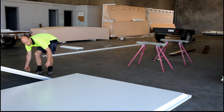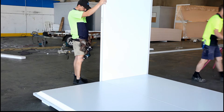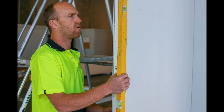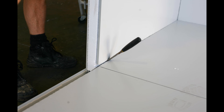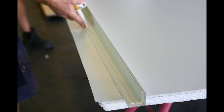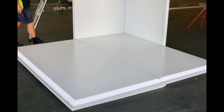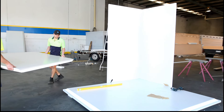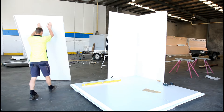The corner edge of the wall is cut at 45 degrees. Fit corner pieces together and check that they are level. Chock the underside with cardboard or the like if required to achieve this. Next, apply mastic sealant to the exterior edging angle and fit to the wall piece.